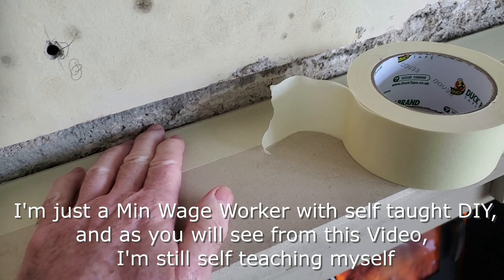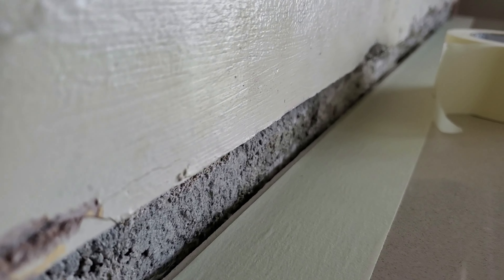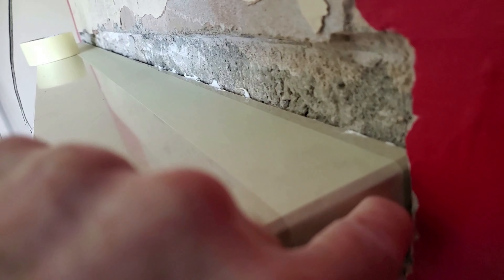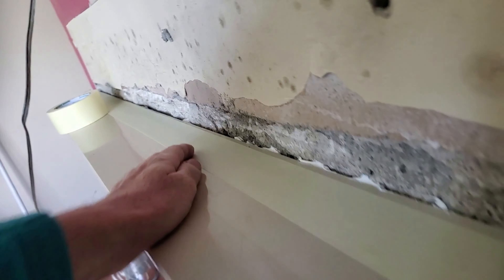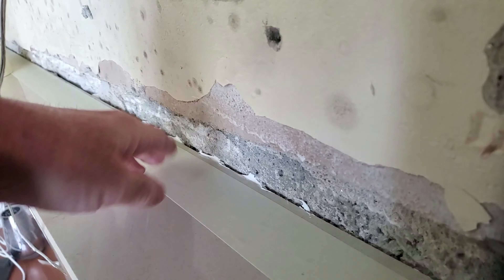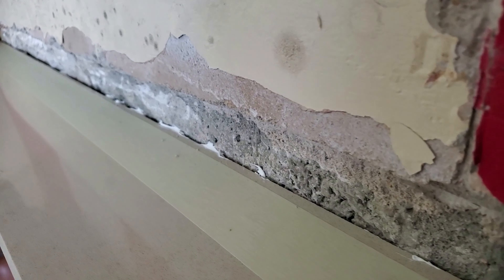I put masking tape on here because I'm going to have to plaster and repaint this old chimney breast. I can't believe how much the plaster is out — whoever built this fireplace is as crooked as anything. The plaster is out a good half a centimeter beyond the masking tape. I'll put the plaster over the masking tape and keep it as level as I can — not pure level because if it doesn't match the rest of the fireplace it'll look bad. I got a ready-mixed bucket of plaster from Screwfix.